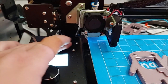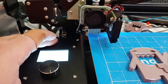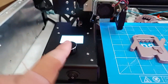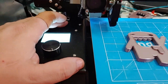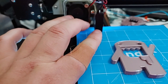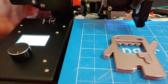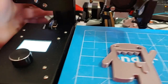We also replaced the brain board fan inside the brain case. That is a 40 millimeter Noise Blocker fan at 2800-2900 RPM. I actually have it backwards — I can feel the warm air coming out the front, and it's supposed to suck that way, so I've got to turn that fan around. But it works, totally silent. You can hear a teeny tiny sound of the fans, and the stepper motors basically don't make any noise — except for the Z, but the Z does not normally move fast so that's normally a non-issue.